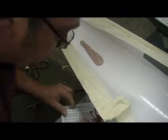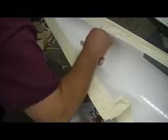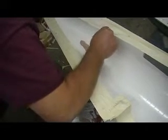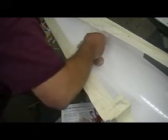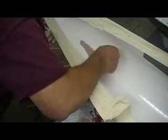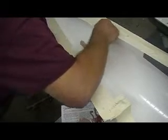It'll stick every time — I don't care how much wax you put on it, you just have to seal Bondo. So we put a coat of thin CA on it, then a coat of primer, and it's good to go.